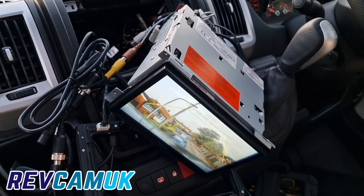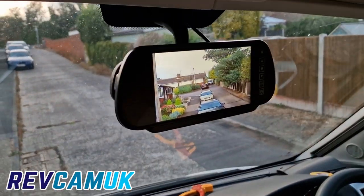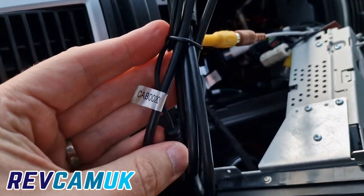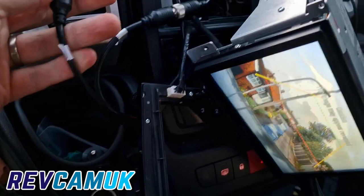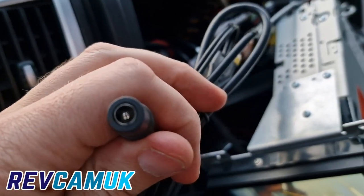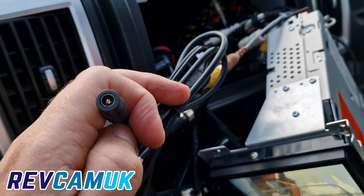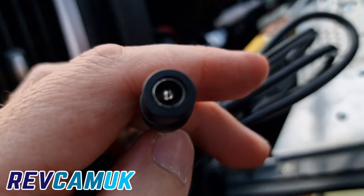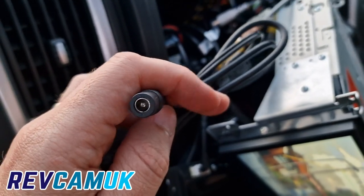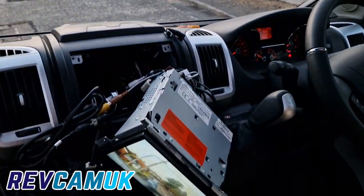I'll pop a little CAB 0020 adapter onto the cable. I didn't even need to provide power to it, so the power supply at the moment is empty. I will pop a little bit of insulation tape just in case — you never know if there's a loose wire, and because they're sharing the same power, there's a possibility that the centre pin has got a positive supply going to it. So I'm just going to wrap that round with insulation tape just for safety, and then put that all back together, and away we go.